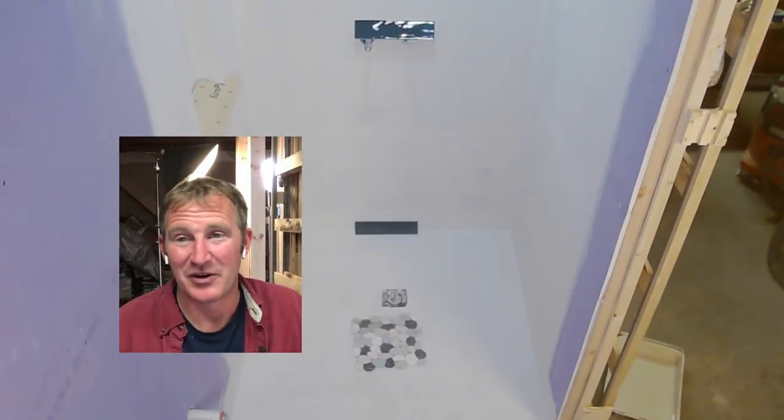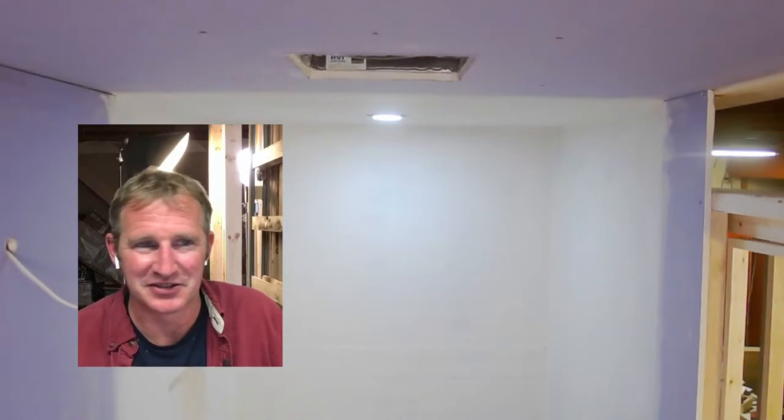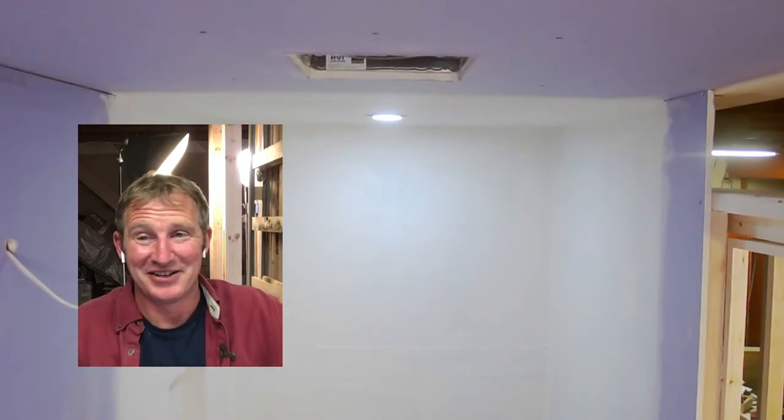Do you ever do projects that include tiling the ceiling? That's what I'm doing here, my man. That's one of the reasons I wanted to do this here in the basement. This basement bathroom, I'm going to end up doing the tile ceiling. Now, we are only doing 3x12 tile, so it's not the super large tile. But if you just get yourself a decent thin set, you're not going to have a problem sticking anything to the ceiling. It really is not a big deal at all. It's just a matter of accounting for that thickness, and you have to take a little bit more care with your cuts, because when you come into a shower with a ceiling, your eye goes straight to the corner, so you want to make those joints nice and even all the way around. And then you obviously want to be caulking it as well.